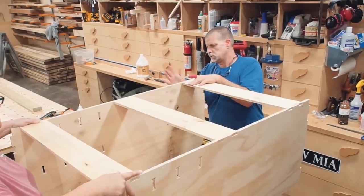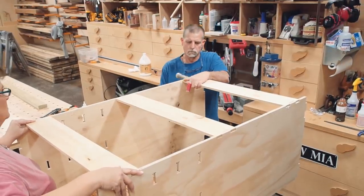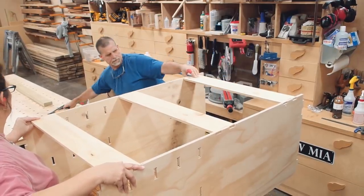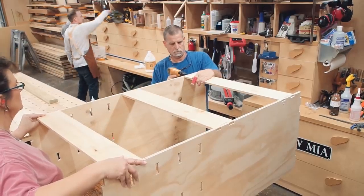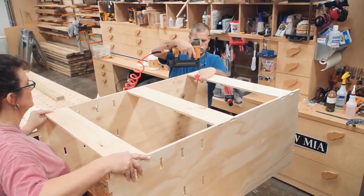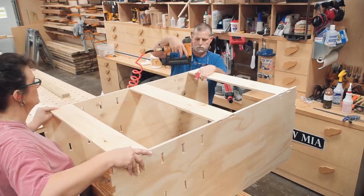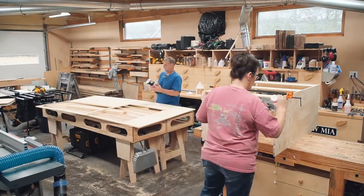The assembly process is crazy simple. This style of construction uses box joints for everything on edge and mortise and tenon for everything in the middle — it's like putting together a set of big kid Legos. We started with the right wall, which is the drawer wall. There are four drawer cabinets on this side with a divider system above, and each cabinet gets two horizontal braces on top, two on back, and two on bottom. After a few sheets, we all settled into a groove and stayed busy.